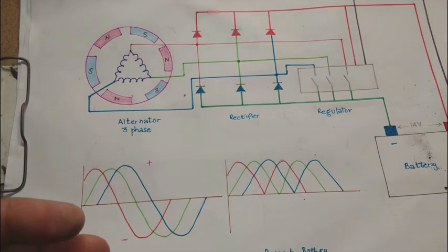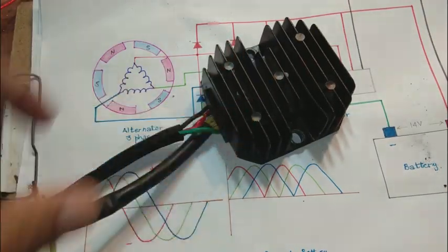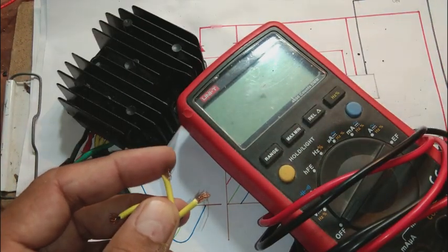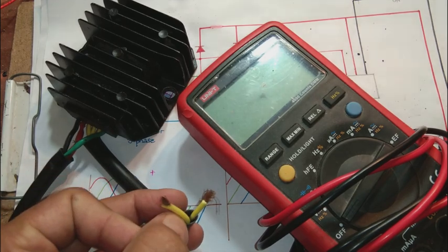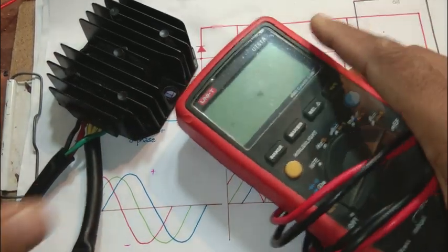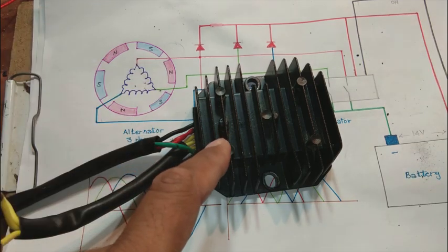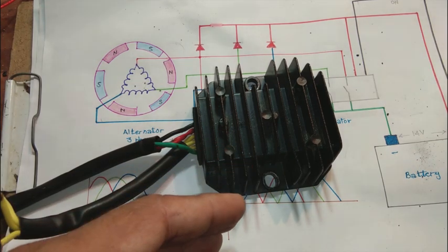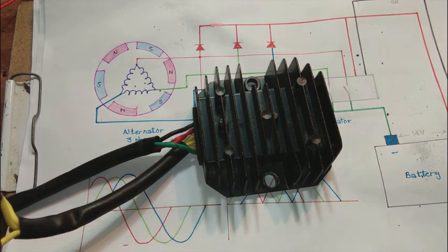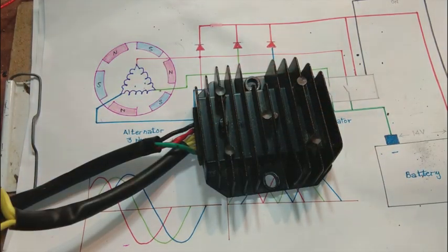Hopefully friends, you have got some understanding from this demonstration. I will bring more videos on this regulator item — you can test the rectifier part using a multimeter to evaluate it, since this rectifier part commonly goes defective. I will also bring videos about faults which occur in such a system and how you can prevent them through preventive maintenance. If you like this video, give a big thumbs up, subscribe to my channel, press the bell icon and select all to get notifications on each upload. Thank you for watching.